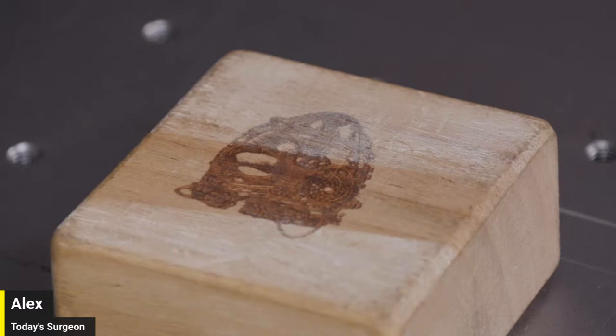A secondary objective would be seeing if changing the settings changes the results that we get. That would be like a two-tier success. We're gonna go ahead and open LightBurn. I know you guys can't see it, but it's open. We're just gonna make a circle here, guys. We're going to go 250 speed, 30 frequency with a pulse width of 16 nanoseconds. And let's see what happens.